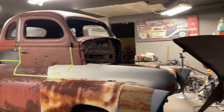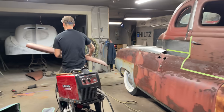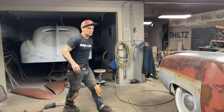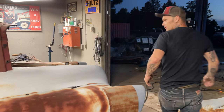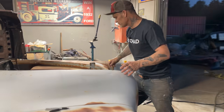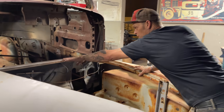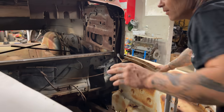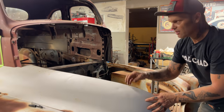Now I got to cut the hood off. So that'll be another test. What's going to happen? This is what I'm guessing. I'm guessing that I'm going to take and bend some square stock steel tubing, weld it on probably the inside here on this post. See, we've got that post welded across there, 2x steel, and the front door post is held there. We'll probably weld in here, and we'll come in here underneath this piece, or on the side of this piece, and weld this piece to the square tubing.